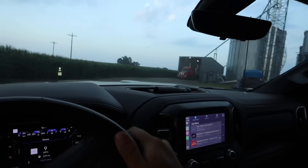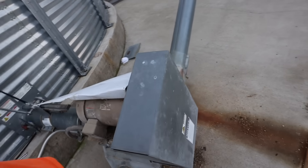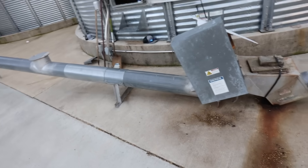It would certainly appear that BJ has beat me here. I guess I didn't show up, but we did get a new bearing and everything's back in business. Now it was not a lack of grease that took that bearing out. We have AGI cables in this bin — basically moisture sensing cables. If you just tie them down with fishing line, well, the fishing line went into that auger, wrapped around the shaft, and took that bearing out. So not ideal — I guess we need to use thicker fishing line.